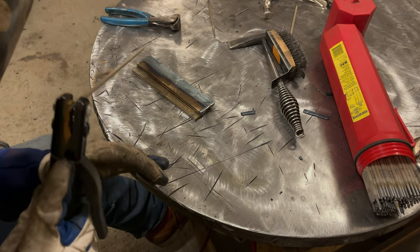This also holds true for fillet welds where you have a plate that just runs like this and you're running a root pass or just a single pass. You always want to have a slight angle favoring where the arc is hitting that top part. And as you can see, it's pretty much a 45 degree angle here, and that's despite having an angle more like this. So use the arc force to fight gravity's wanting to sink the puddle.